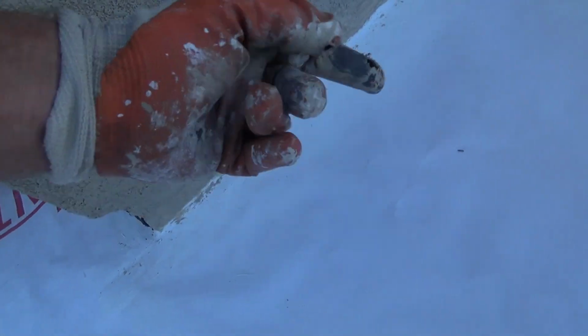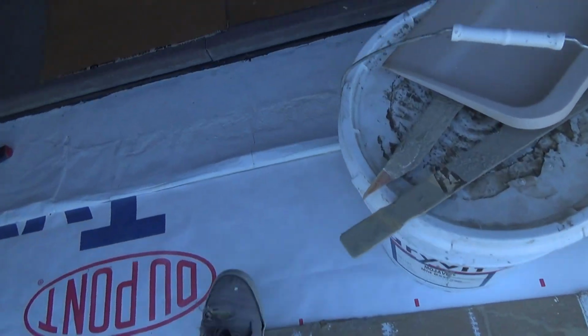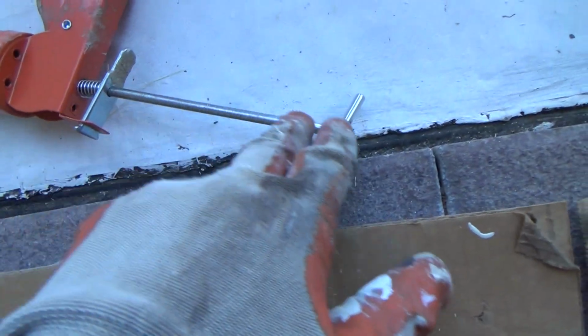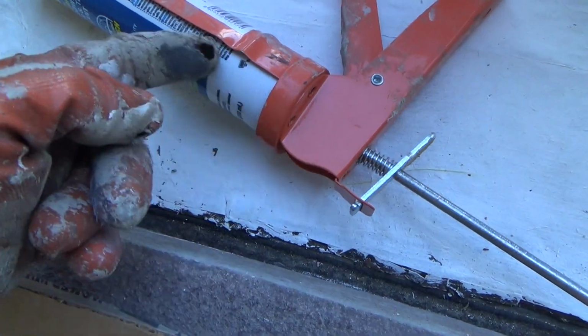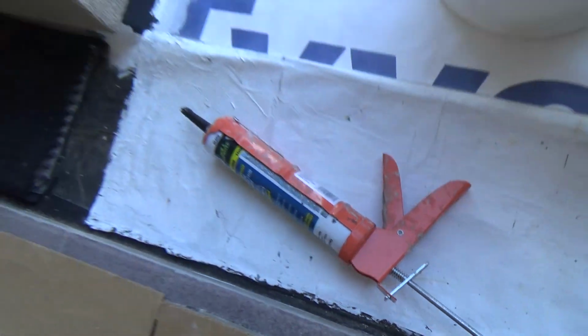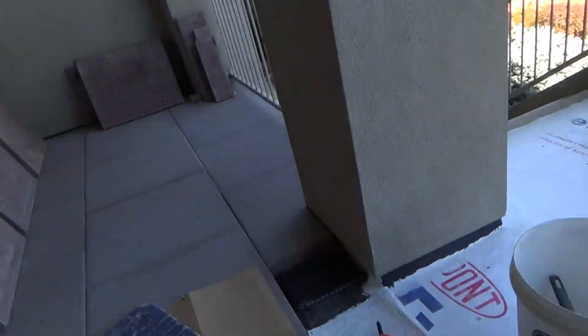This one here, I didn't really have a stucco defect here, did I? So that's why I wrapped the roofing material up with the cloth and stuff up here, and then I went over it with the stucco patch. Okay, so now you see, I said I got 2 tubes of caulking, and I'm hardly, see how long the plunger is? So the plunger's probably only in that far. That's about as much caulking as I use to blacken all this out. Didn't take much, because all I'm doing is skinning over it.